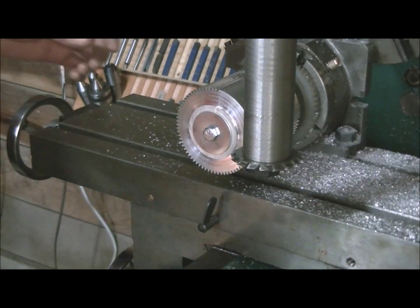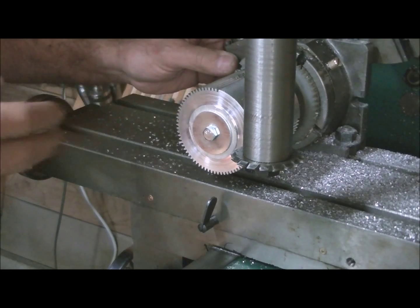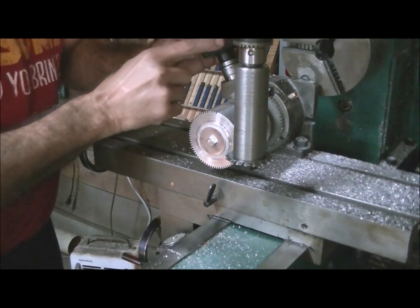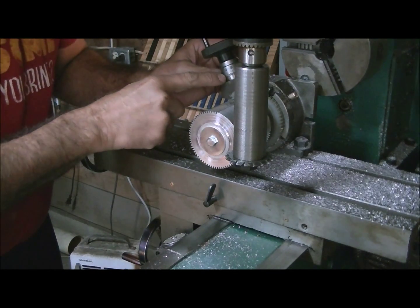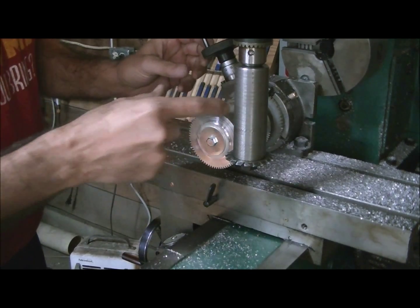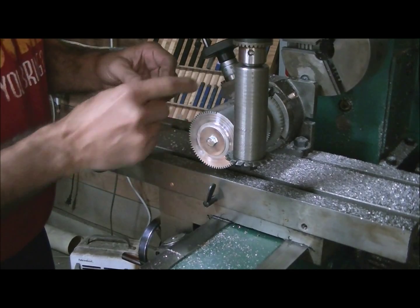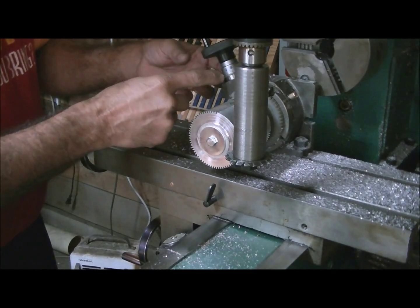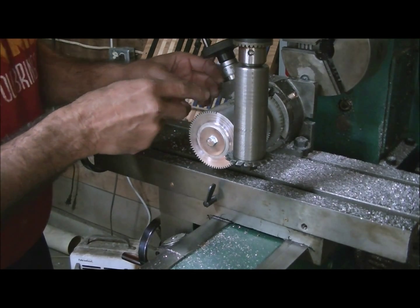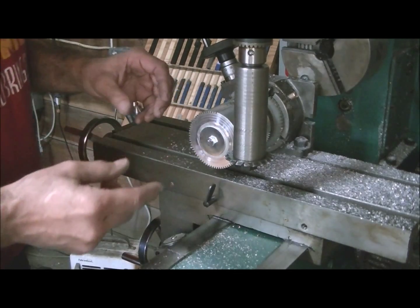What I'm doing is I've got a little tiny Grizzly four-inch rotary table back here. Let me zoom out a little bit more. It's got a crank here and there's a dial, and I'm reading this dial — every five degrees I'm cutting a tooth. That equates to 360 divided by five, which is 72 teeth. There's a little backlash in this, so I'm making sure I only turn it one direction and that I don't go past my five and zero mark. Every five degrees I cut a tooth.